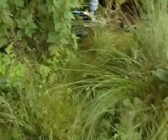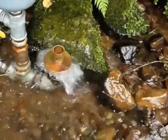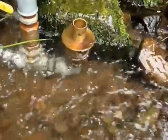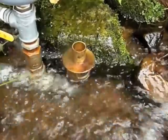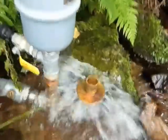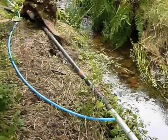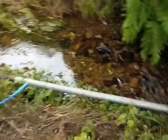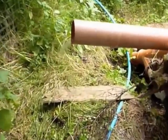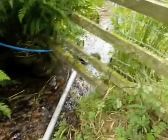I've made a couple of changes to the ram pump. I've put a proper pressure vessel on. I've also put a weight on - see that there - it's actually a brass candlestick that I've soldered to the top of the check valve to give it a bit of weight, so that it holds the check valve open a wee bit longer and gets a bit more speed in the water. I've also increased the length of the pipe - I've got about six metres of drive pipe now. And I've got as much head as I possibly can - I've dropped it as low down as I can into the stream. That's where the water's coming out there - that's the head I've got, which is less than a metre I would say. But it's better than it was. And I've got that chugging away there now.